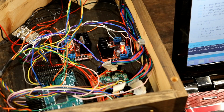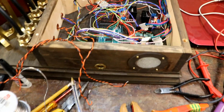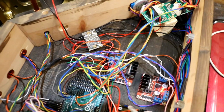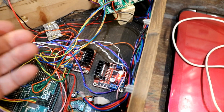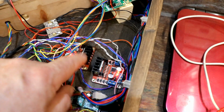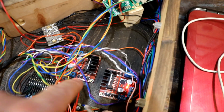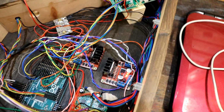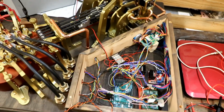I will now try that for your delectation. Thank you. Look, no USB supply or computer. I've connected the output from that one actually to the 5V bus. That's fantastic. So I was thinking I was going to have a 7805 voltage regulator separate to this, but I don't have to, and I'm only using one of them because there's no point. They've got thermal protection and overload current protection, so theoretically things can't go horribly wrong, but right, so that's great.